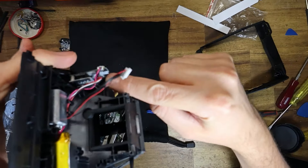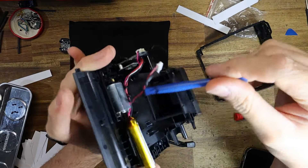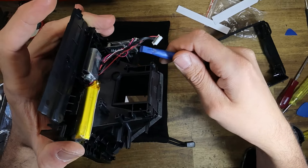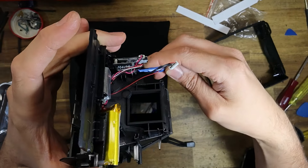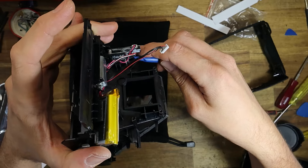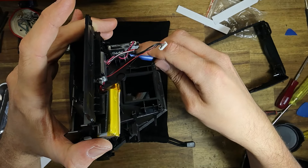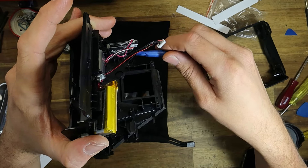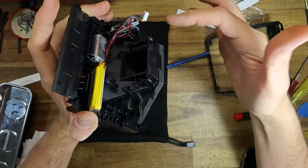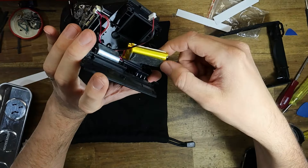So this connector that attaches to the PCB — the leads that go from the battery onto the PCB — this connection is held so fast. It's got two little barbed clips so that once it's clipped in, it's really not designed to be taken out again. It honestly feels like I'm going to snap this thing because the plastic making up this little connector is very brittle. Despite using a plastic or metal spudger, I'll probably just leave it plugged in and snip the wires closer to where they enter the battery.